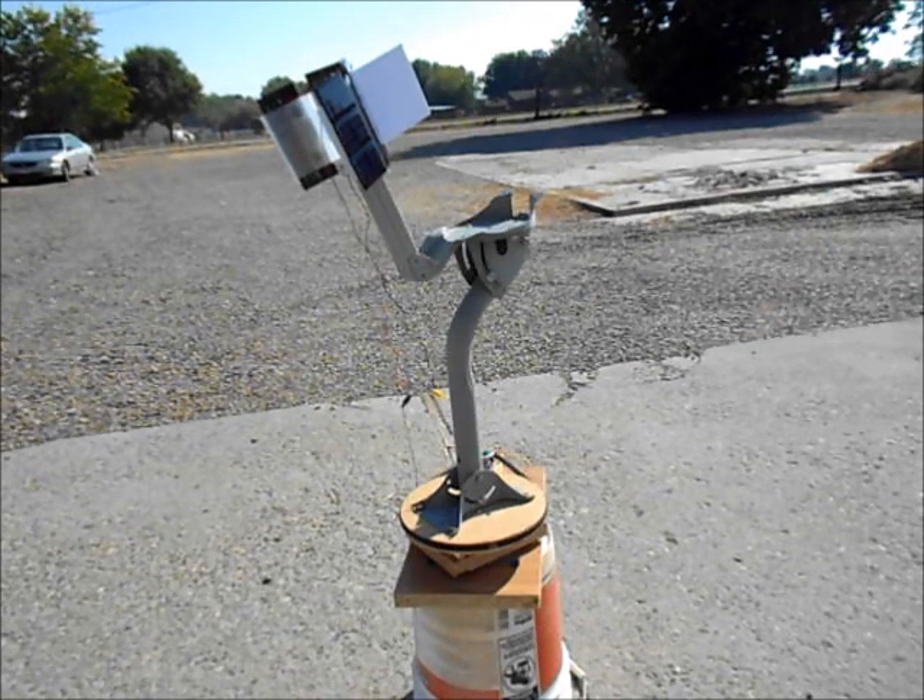This is not a novel idea — it's been done before. But the part that hasn't been done before is orienting the cells a little bit off-angle from each other, even on the same side, so it will more easily reorient itself in the morning light. That is a challenge with this device: you need enough power difference between the cell sets to drive the motor. Catching that difference in the very first light of morning — to get from west to east — is a challenge, and that second orientation of the second set of cells allows that to happen.